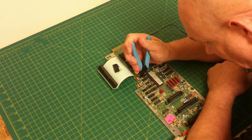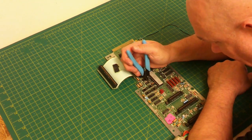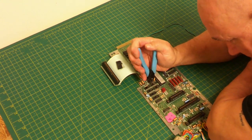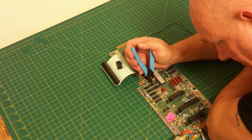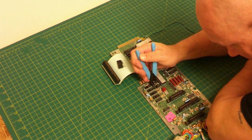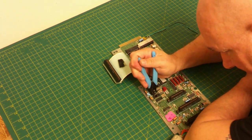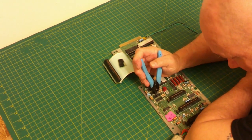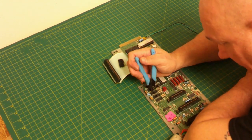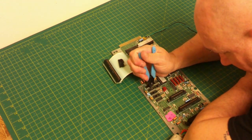The normal way most people would do it is they'd have a desoldering station, remove the solder from the back, then use a copper wick — solder wick — to try to remove most of the solder, then work the chip out. Though this does work, you can end up ripping the traces off. I have done it many a time. So this method works very well — I got these little nippers that actually came with my 3D printer and I use them to clip all the pins off the RAM chips.